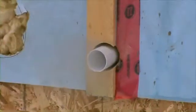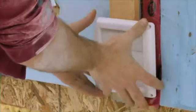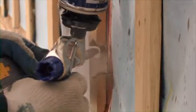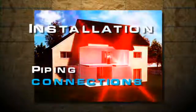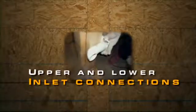For an exit inlet, cut about 2 feet of PVC and let some slack hang outside. Glue the exit inlet to the extruding pipe. Adjust the position of the exit inlet to the intended exterior finish of your house. Add the isolating urethane, then let dry before connecting more pipes inside. With all inlets in place and bypass elbows glued on, you can move on to piping connections.